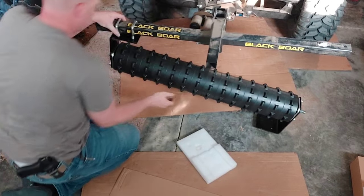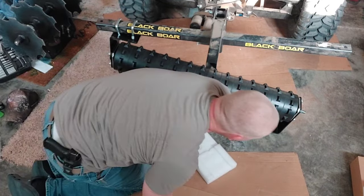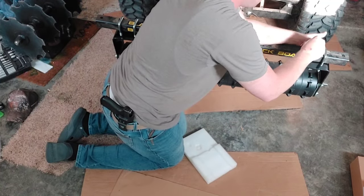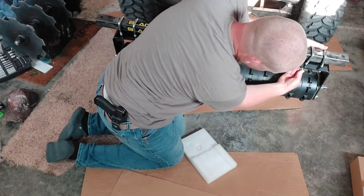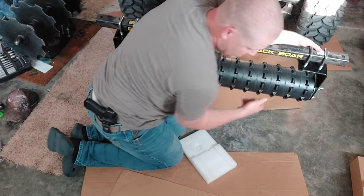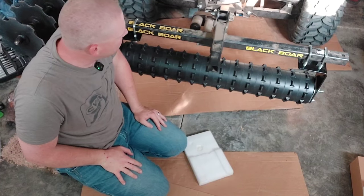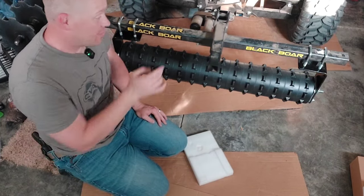See how that is now on this side. Now what I'm gonna do is go over to this other side, put this U-bolt here like so, and this one like so, and just do the same thing I did on the other side — put those washers up on each one, a lock nut on each one. Then we're about to be cooking with gas and put some seeds down in the dirt. I'm gonna get all this cinched up, get it centered up, and then we're gonna trailer this baby up and head back out to where we did all our plowing and disking yesterday.